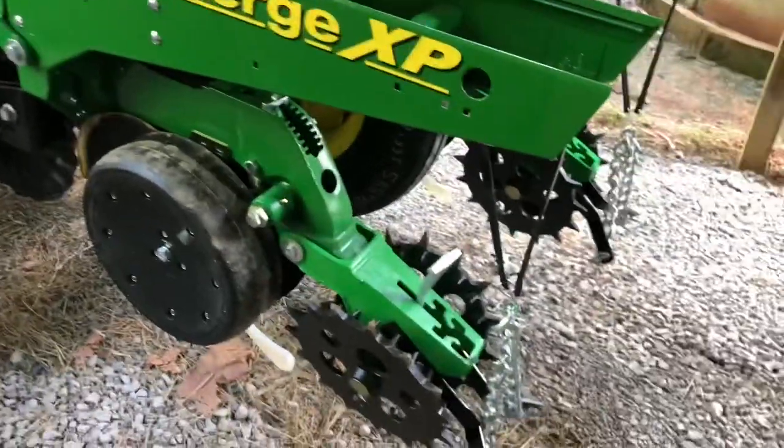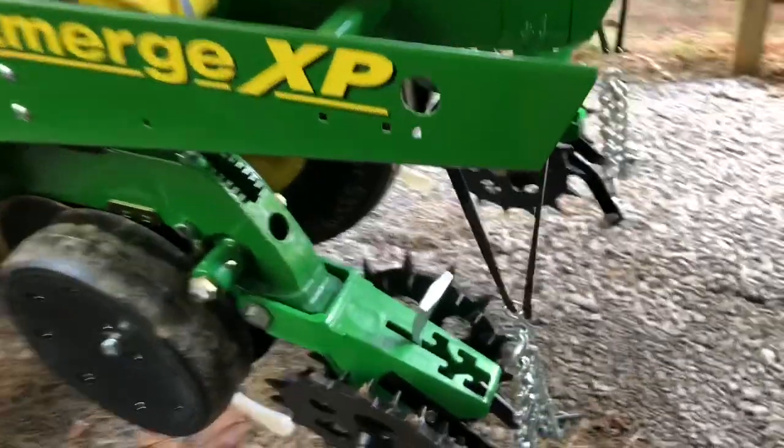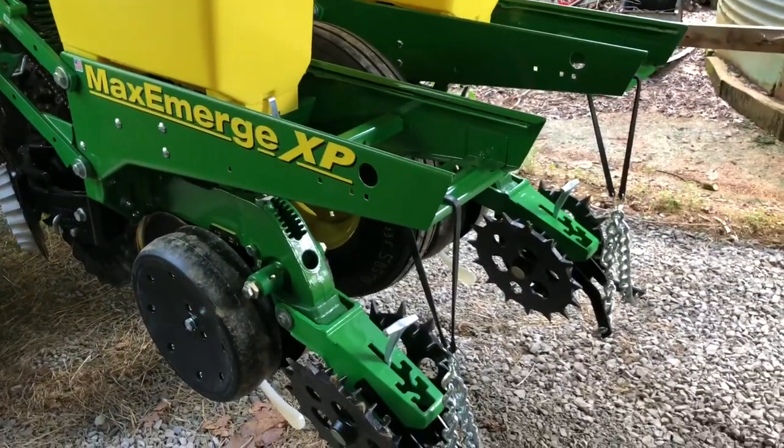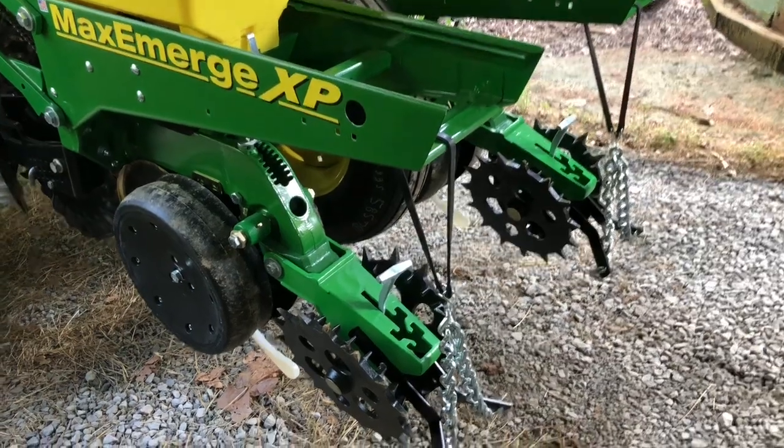You just saw me do a dry run test with some seed on the ground and count them. I did make an adjustment to my seed meter brush — that part of the sticker right there. In my calibration I played with it between positions: the top center one is a 3 and the one to the right is a 2. I had it on 2 and did the dry run, but that little chart is made to compare to your seed size. Number 3 was actually closest to the average size of my seed. There are half-step notches in between — a 2.5 and a 3.5 — but I adjusted that little lever back to 3, and that's where I'm going to leave it because it seems to be the best spot.